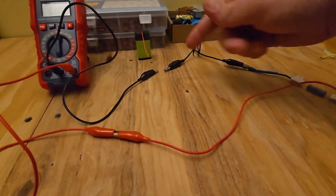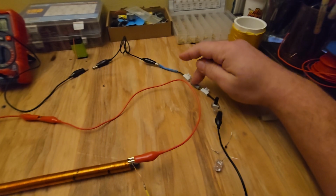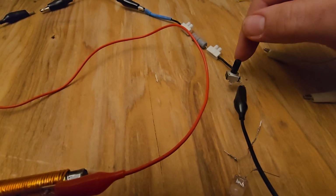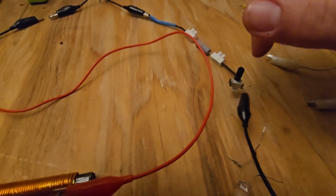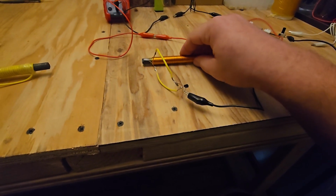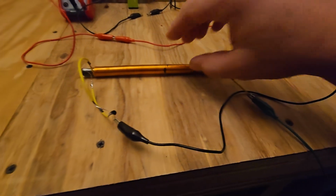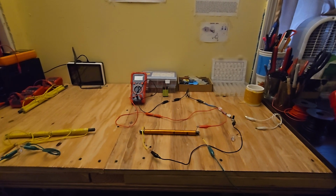We power it off a rechargeable 9-volt battery. We limit the current with a 50K 5-watt carbon film resistor. It has to be carbon film when you deal with radio devices. It then goes through a potentiometer. I believe it's a 20K potentiometer at 1 watt variable. And yeah, the circuit has just become so clean and dead simple now. And it's self-activating. I think this is the way forward. Earth grounded here heavily. Give you a good look at it. Feel free to pause it or anything.